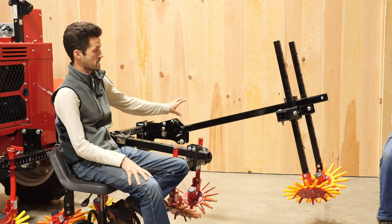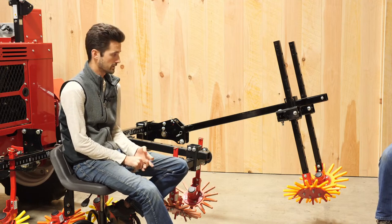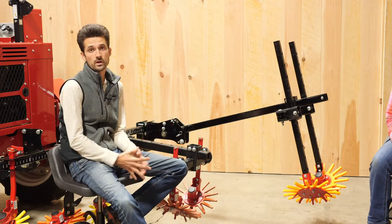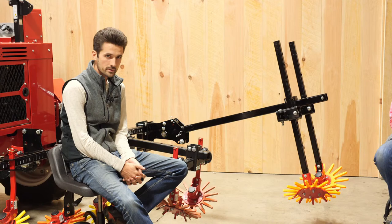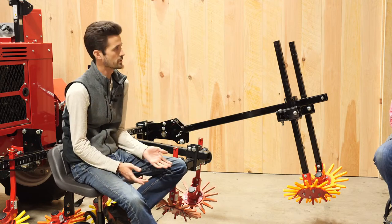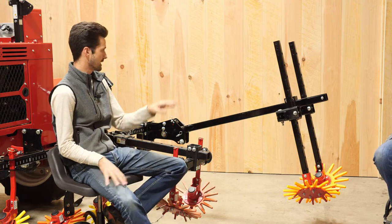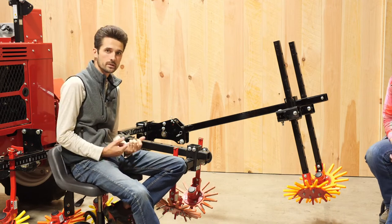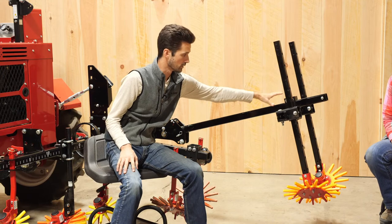The large trailing arm — we do have an overview video, check the link in the description, also for finger weeders in general. Again, this isn't so much about the function of finger weeders as it is about how to get them set up on your farm. Typically your larger row crop farms are doing wider spacing — 30-inch, 15-inch — and that's where these 15-inch finger weeders work really well. You can use 13s and 9s, but a good rule of thumb is bigger is better if you can fit it. The large trailing arm gives flotation flexibility in your system, a robust mounting method with the inch-and-a-half square tube, and different cross clamps.